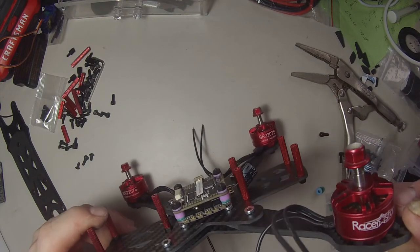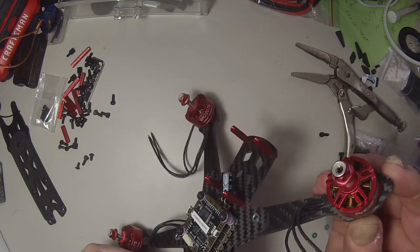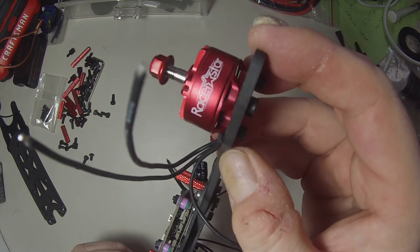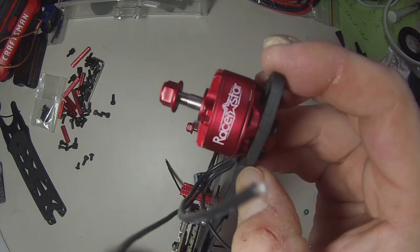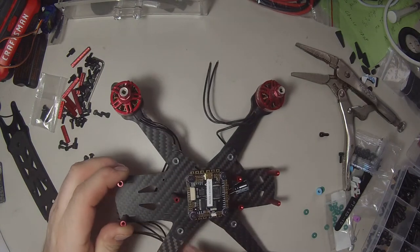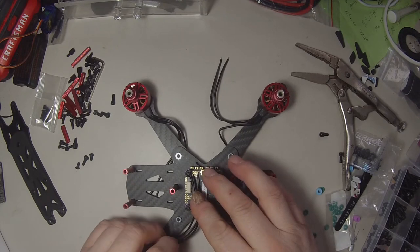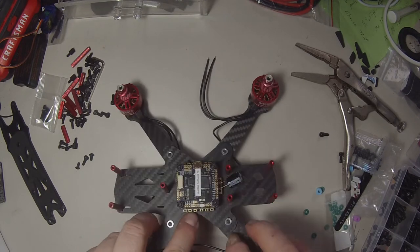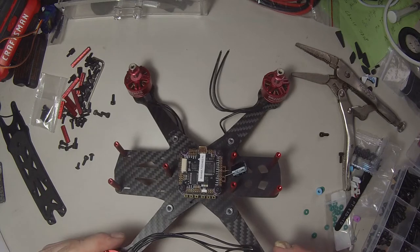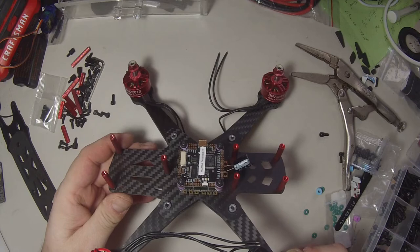You've got to be careful on your motor screw sizes because the motor manufacturers — they're usually the ones that send the screws — they don't know how thick your frame is going to be. You can have a 6mm, 5mm, or 4mm frame and they don't know. Even if it's a 4mm frame, it can vary a lot between manufacturers. So these can just come in like that onto the ESC, and we can map out motor directions in BLHeli or Betaflight.